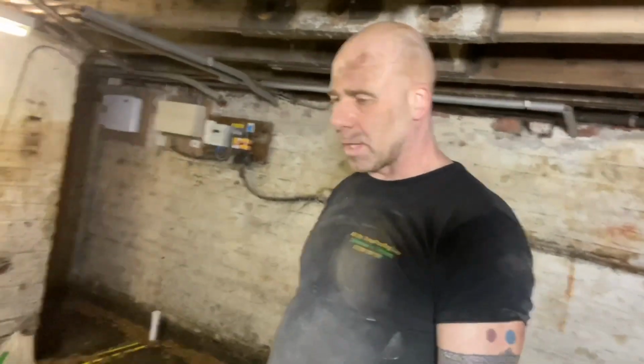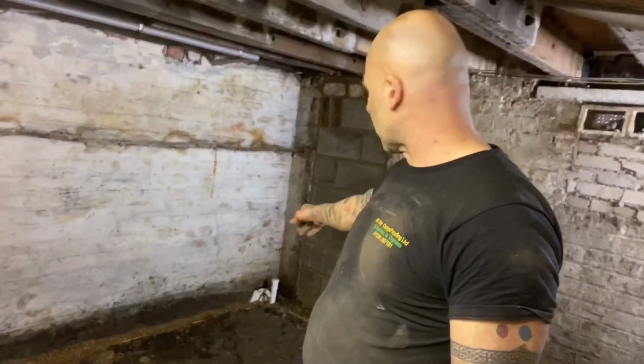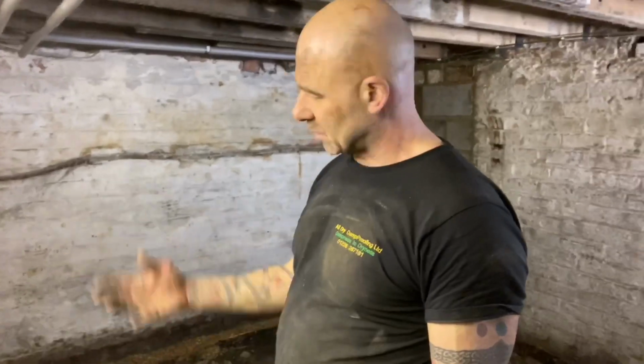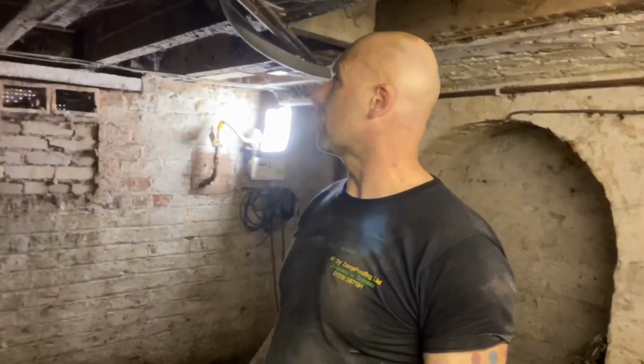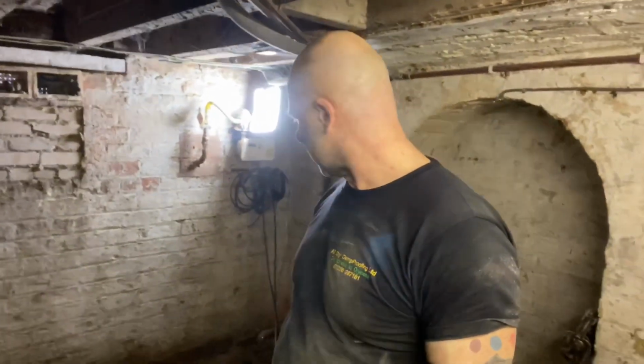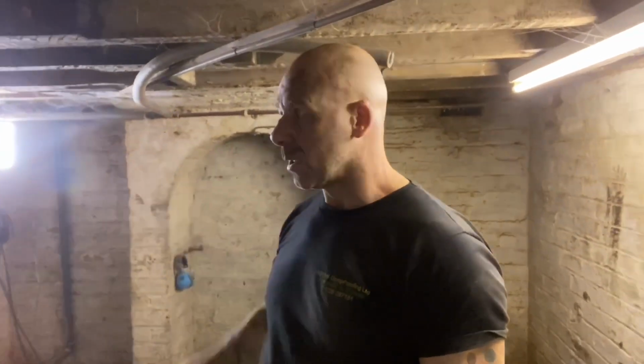Like I said before, get some pea gravel. I'm going to have to top these up, and then the membrane goes down on the floor, and then there'll be decisions made at a later date on what they want to do. My recommendation will be just pour a slab straight in. We've got these jetting eyes, so the system's maintainable. You've got your pumps in. It's just going to be restricted with height, so you've got 100mm screed to go on. Probably might be a bit deeper there. Then they can choose membrane on the wall, some insulation, studded, plasterboarded and skimmed,